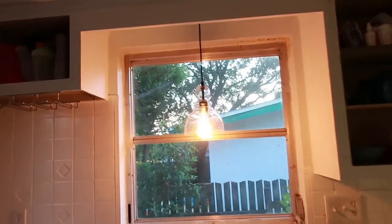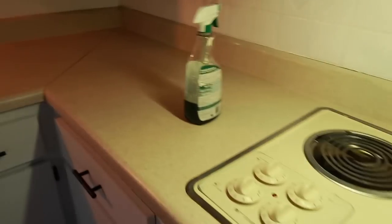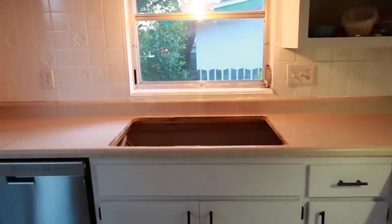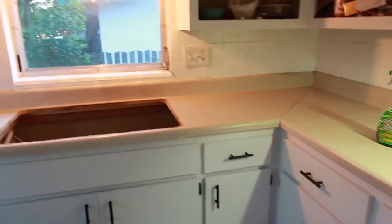John hung up the light — I absolutely love it. Now I just wiped the counters down with Simple Green. I'm going to now sand the counters lightly with a 120 grit sandpaper and then I'm going to wipe it down with a bleach and water solution before I get to painting.